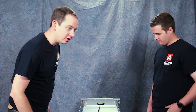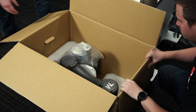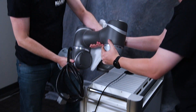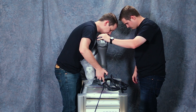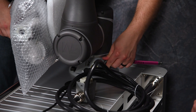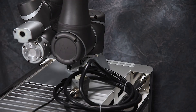Now that we've got the control box assembled and mounted in our cabinet, let's work on getting the robot arm ready. As we open this box, we can see the arm is packed away inside. Getting your partner to help you, we're going to pick up the arm. As we saw earlier, this arm mounts onto the bolt pattern on top of our machine. Once you get it aligned with your bolts, we'll secure it with four M10 bolts. Once everything is tightened down, we'll remove the extra packaging and get ready to plug everything in.